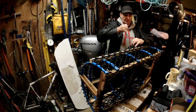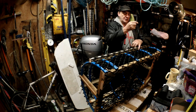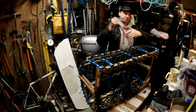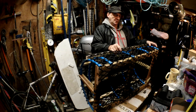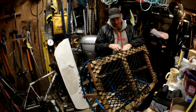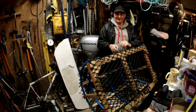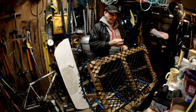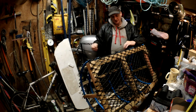Three to four mil is the right range. Four mil is fine; three mil can get holes in it if you're using it consistently and it's out there in storms. In calmer areas three mil might be fine, but if you're exposed out in the North Sea you might need four mil. I've seen pots in the US and Australia that if you tried using them here they'd last maybe a week — they can take a storm or two, but our storms can rage on for two weeks.